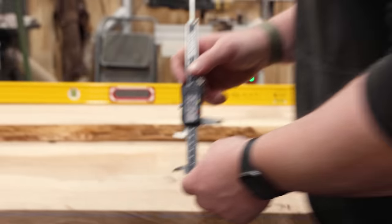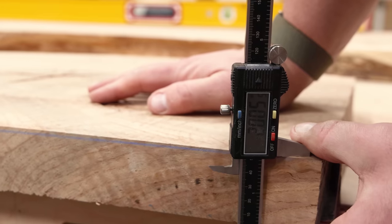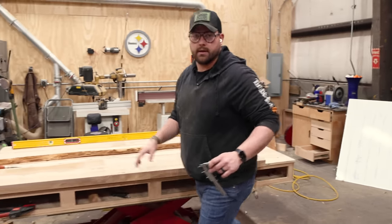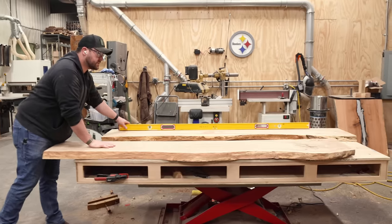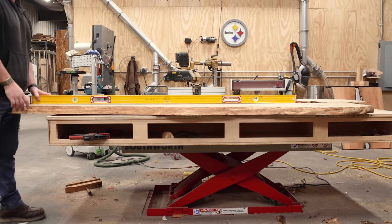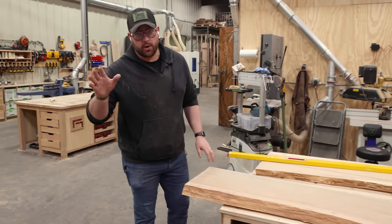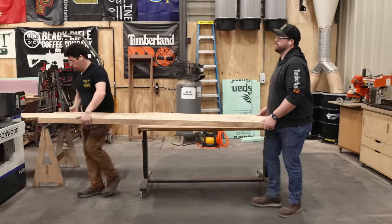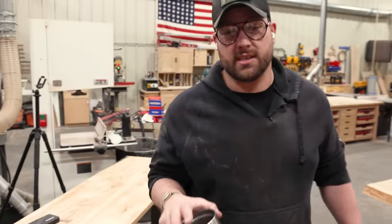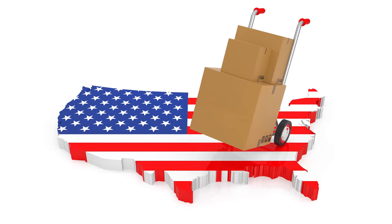I measured and we're at 2.18 here, but at this edge it's 2.14. In a different part we're at 2.17 and then 2.0 — so there's more material in that section, which is going to be higher. When I flip this, this side's been surfaced but you can see that bow — it's racking around on the table. We've got about an eighth-inch gap. These are about a quarter inch over what I want, so I'm going to put this side down, run them through the planer, and reassess. You can't just trust everything you buy from a sawmill — unless you're buying from my sawmill. We do have a ton of slabs available at J&J Lumber Company; there's a link in the description and we ship all over the United States.